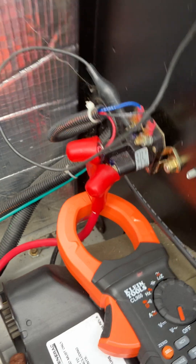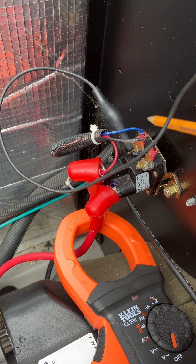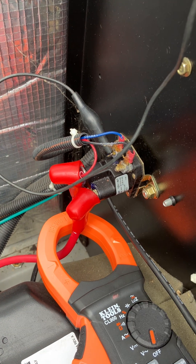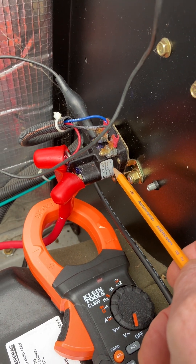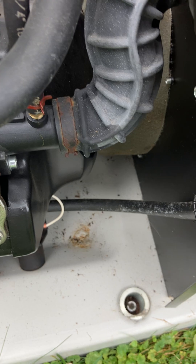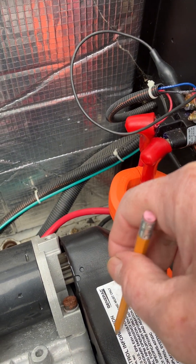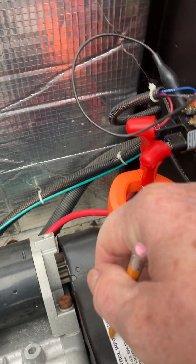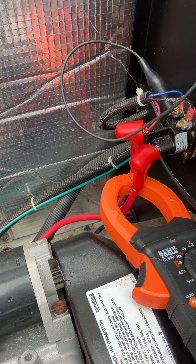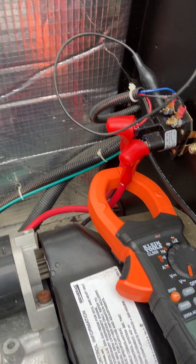What I noticed on the unit I was looking at is I wasn't getting the signal here for — I don't know, I didn't even get to a one-Mississippi — and the 12 volts was gone. Then I tried it in manual and it started right up. When it starts right up you know the battery is good and the starter is good. The RPM sensor, I think it's this one down here — it's like a proximity device and the flywheel has a bunch of flat teeth. It spins and the proximity device looks at one spot, watches the teeth go by, counts them, and knows the RPM of the engine. But that unit didn't even get that far — it didn't even spin the starter.